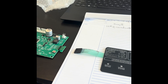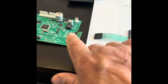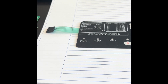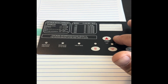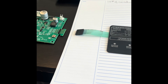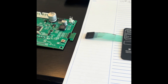So if you have a Master Temp 400 Pentair heater and you've replaced your temperature sensor and you continue to have issues and you diagnose it as being the board or the membrane that is faulty, you'll purchase one off Amazon likely because it's cheap, maybe $100 to $190. As shown in the previous video, the up and down arrows do not work and it shuts itself off after about four or five hours. You have to reset the breaker, and I had to do that the entire winter every day just to make sure that the pool water temperature stayed above freezing so we didn't have catastrophic failure.